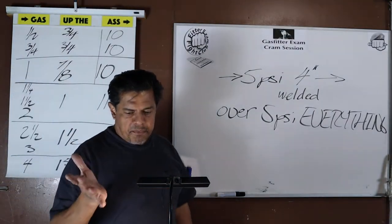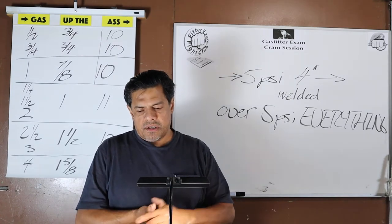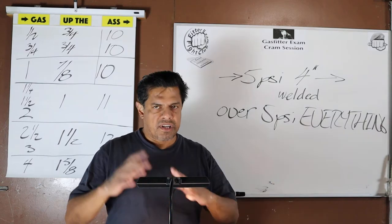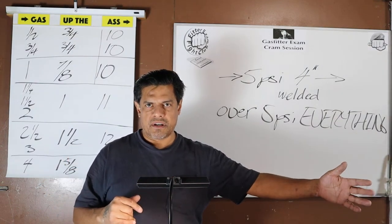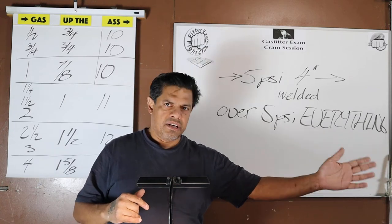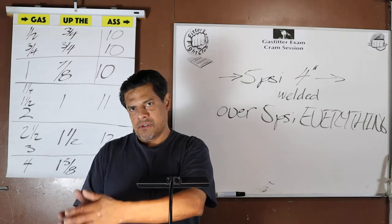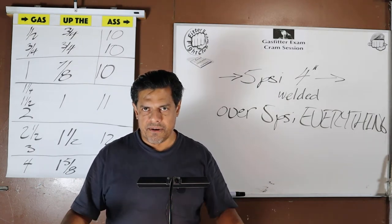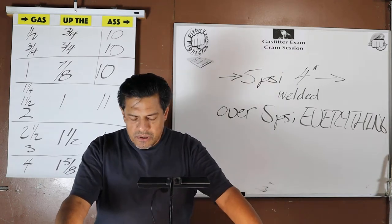Okay, there's an exception to everything. So we already established that up to over half a PSI, or we can just say up to 5 PSI, because we know what happens with half a PSI. Up to half a PSI, you can have a 4-inch fitting. At 5 PSI, you've got to weld your 4-inch fitting. Over 5 PSI, everything gets welded. But there's an exception. There's always exceptions.